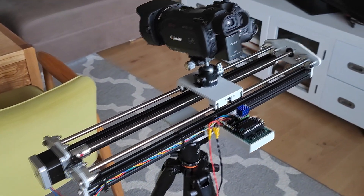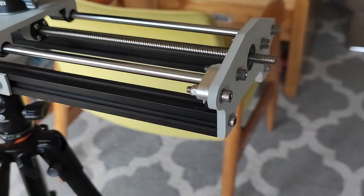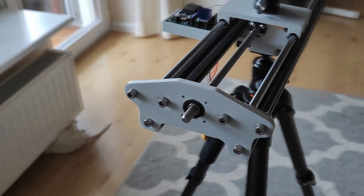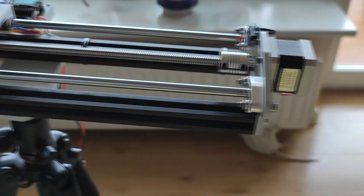As a result, I have half a meter, which is approximately 20 inches of rail available to carry my camera wherever I want in one axis so far. There is a plan to extend the camera slider with a second axis for pan capability, but I'm waiting for small enough stepper motors to fit on the platform. The electronics is already prepared to accept a second stepstick driver, so I won't have to redo all the electronics again.